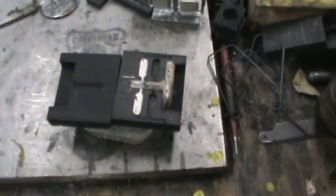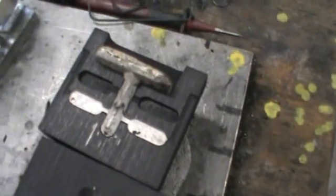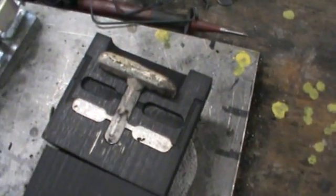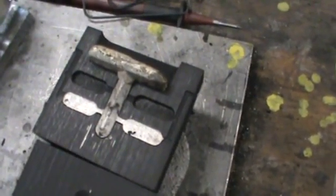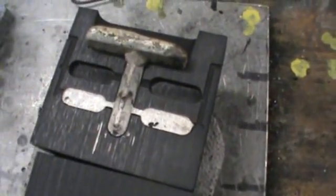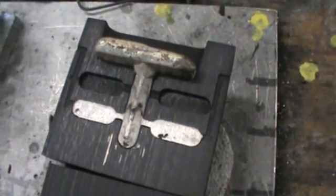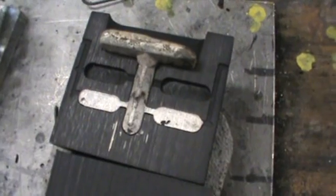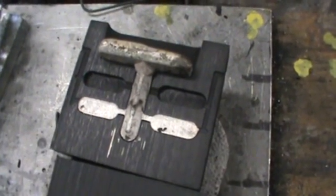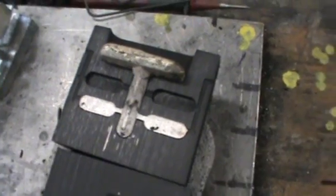Here's one of the many mysteries that just baffles me. The bottom two chambers poured themselves perfectly. This is a gravity mold, and the top two chambers — looking at the sprue stem — didn't even try to fill the cavities, and they're all equally vented. I'll never understand molten metal. It does not do what you think it's going to do. That's what makes this so fun.